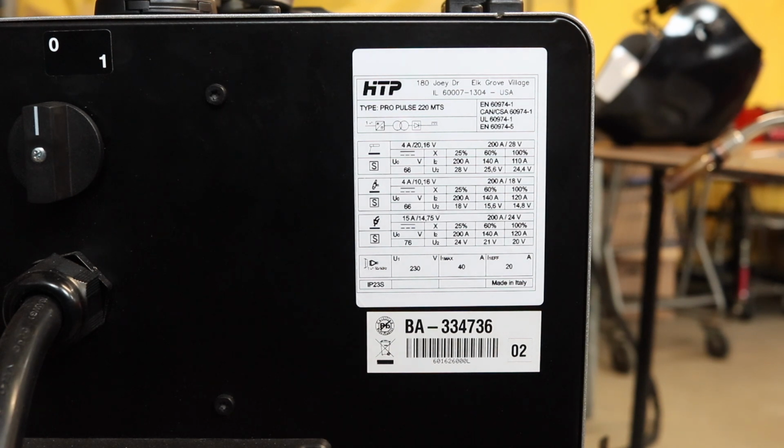Now, depending on if you're in Arizona and your cooling air is 100, 110, 115 degrees, those 4 minutes may not be enough. You may have to shut down for like 8 or 10 to let it cool enough. So now when you start welding again, you may not automatically see another 2.5 minutes of service because you didn't let it cool long enough. In other scenarios you do. So duty cycle is a very individual thing for you, for what you do, for where you are, for what your ambient temperature is.